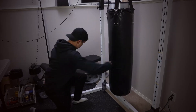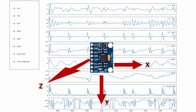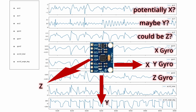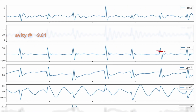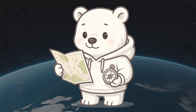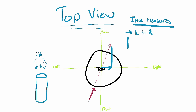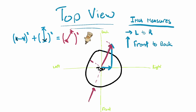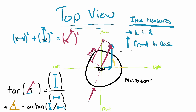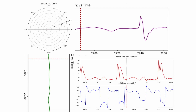So I recorded some sample data and I can sort of visualize it with a bit of code. Because this is a three-axis accelerometer, we've got the different axes of acceleration plotted. Ignoring the vertical axis for now, to merge the forward-back and side-to-side axes together, we convert to something the higher-ups might call polar coordinates. So for example, if I punch from a given angle, the sensor picks up a little bit of left-to-right acceleration and a lot of forward-to-back acceleration. Using Pythagoras, we can calculate a value for the total magnitude of acceleration in that direction, and then use trigonometry to figure out what angle the sensor accelerated at.